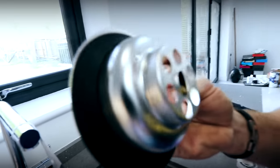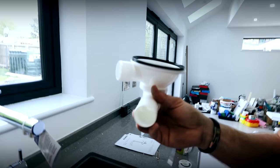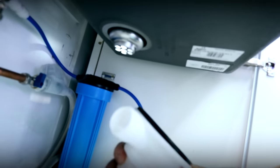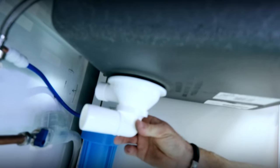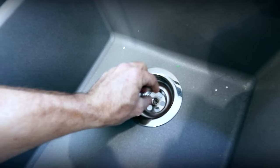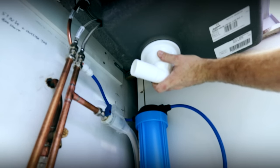So we've got our bit here, we've got our rubber on there just like so, and we're going to pop that in there just like that. Now we've got our outlet piece here that's also got our integral overflow already attached. This is going to slot up under here - we're going to face our outlet, the little threaded outlet, to the back, because then that lines up exactly where our overflow is. We've got a nice little rubber seal on the bottom, and there's a little screw with a slot in it that pops in our hole. Then using a big slotted screwdriver from up top, I can marry these up from the bottom, get this on, and just nip that up.